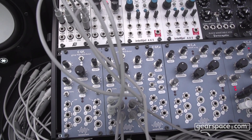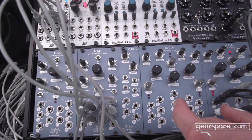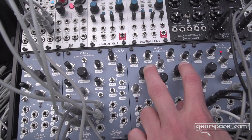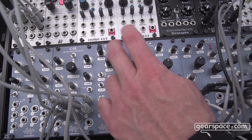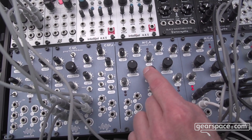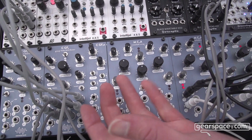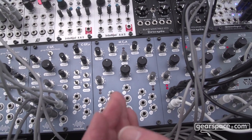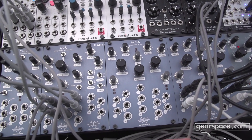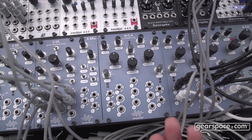The other new module is the MC3A Crossfade Array. It is three crossfades in one body — two of the crossfades are in parallel for inputs, two inputs per crossfade, and those crossfades are then routed to the third crossfade. It allows for fairly complex morphing between audio signals, and since it is DC coupled you could also feed it LFOs and build very complex modulators that are very fluid, very organic, but somewhat chaotic and still periodic.